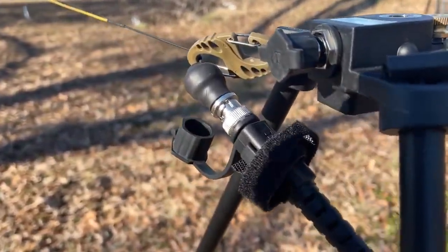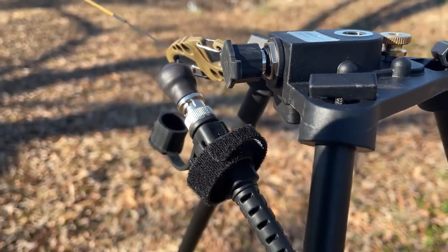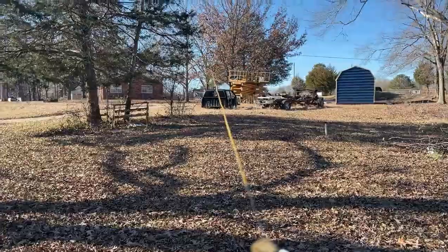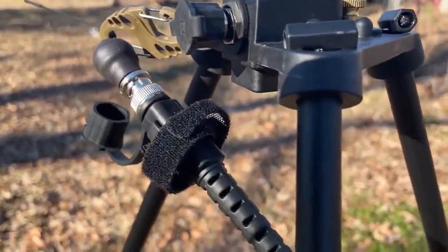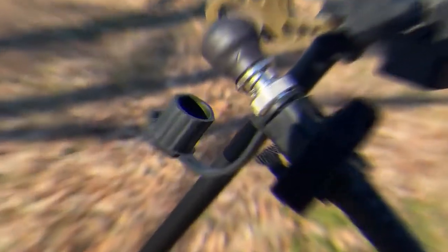And there is the K6ARK antenna — fits right on the end of the coax. We just got it stuck up on the Buddy Stick Pro Tripod, giving it elevated off the ground a little. Got it going through a carabiner, and the wire goes up into that tree and then back down to some bushes under it. Man, this thing is receiving great. Not the greatest idea to test it out QRP during a contest weekend — kind of hard to get into some of these stations QRP. But we did make a couple of contacts on it. The K6ARK antenna — it looks like just a bundle of wire, the feed point is in there somewhere, that's how little this thing is. The wire is the biggest part of it. A wonderful kit, excellent directions.